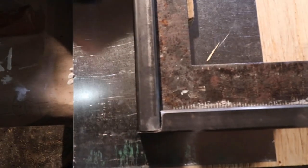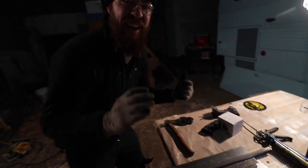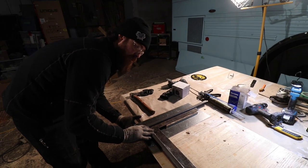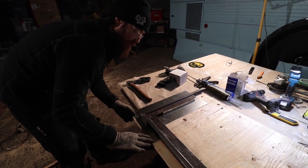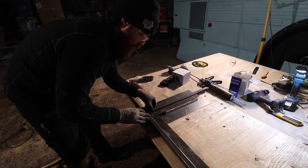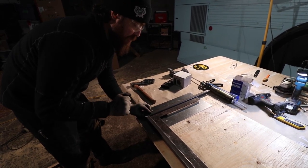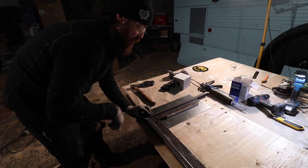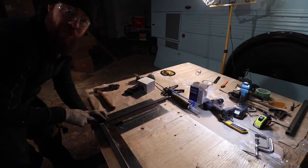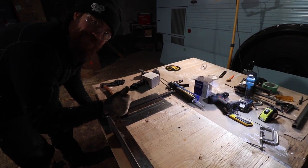The idea is if we can make a perfect 90 degree in every corner, it'll end up being a nice squared rectangle. Having this plywood here — it's a nice straight piece, nice and flat — we'll be able to tack it, tack the next one, tack all four of them. Then after they're all tacked, we can dry fit it, make sure it's nice, and if it fits in the hole real nicely, we'll go ahead and finish the welds off and then clean them up. That's how I'm squaring it up — it's a good idea.